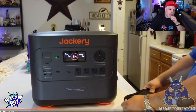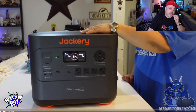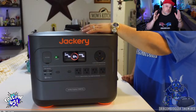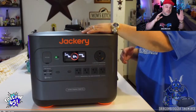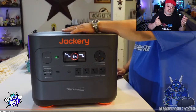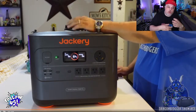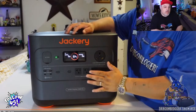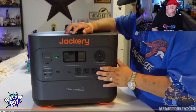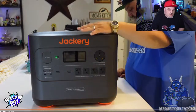It is 3,024 watt-hours, so you should be able to run a fridge about four and a half to five hours, maybe a little longer, depending on the model. Keep in mind that's with the fridge completely closed — open it up and your refrigerator and freezer will kick into a more active mode, so the minimum runtime I'd say is about five hours. You could also run a 1,150-watt window AC off of this for a couple hours with no problem.